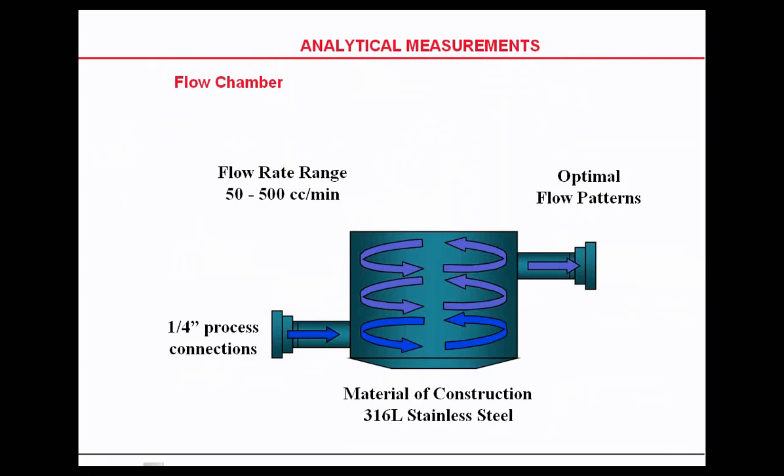The sample is very clean, so to help the salt bridge to be developed between the measuring and reference electrode, we not only use a flowing reference but we swirl it so that we get a nice uniform pattern.